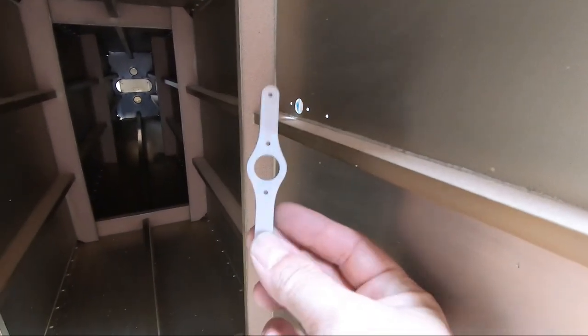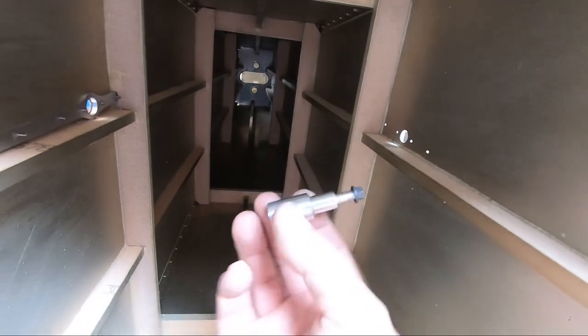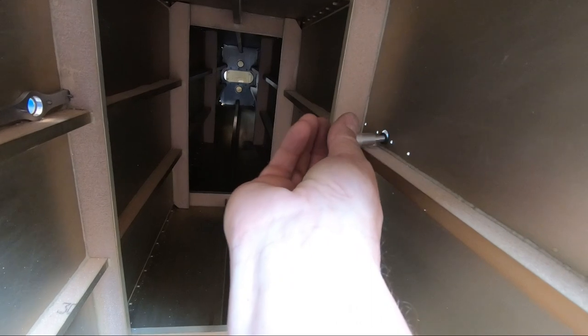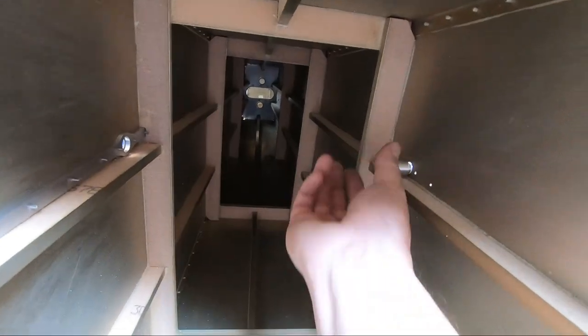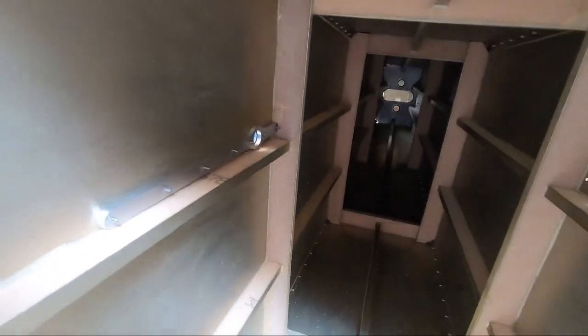On the top side, there's a smaller bracket that gets installed on the upper surface and gets bolted into place. The reason for that is you can take the top part out — the bottom part stays fixed. When you install the tube, the upper mount has a longer, thinner machined area that fits through the hole and allows the tube to go up through the top and then into the bottom mount. The top mount is removable so you can get this assembly in here by fitting the tube through the top of the fuselage and then fitting it down into the bearing hole that's fixed into place.